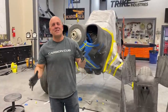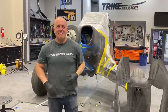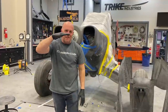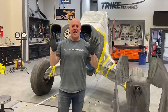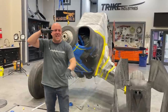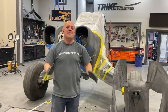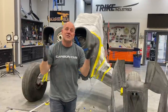I'm super pumped. This is coming together really good. I spent a lot more time than I really would have liked to, but it's worth it — figuring out all the angles that the aircraft can fly in a level flight attitude, a tail-low attitude. And like any tail dragger, the lighting is always good for one or the other, rarely good for both. You set it up for a level flight to land two-wheel at night, it shines down the runway, and as soon as the tail goes down, the runway goes dark. Or vice versa, you come in three-point and you can't see the runway at all.